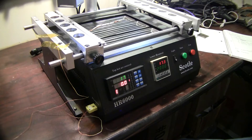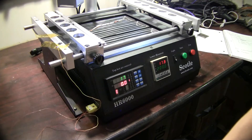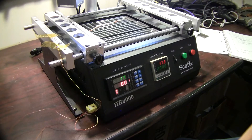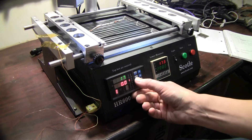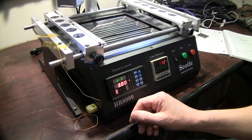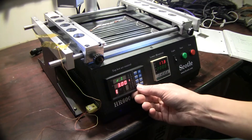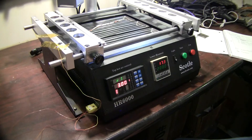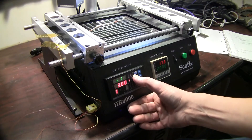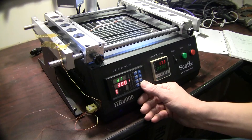So the question is: what's R1, what's L1, what's D1 — what do those values mean? Your R1 is your ramp rate, and most machines have the ramp rate built in so you don't usually have to set that. Typically it's going to be between one and three degrees per second. On the IR6000 or the HR6000, three is fine for your R values, and it's going to be the same for all your R values — so all your R values will typically be set to three. Your L1 is your target temperature and your D1 is your time you're going to go to that temperature.